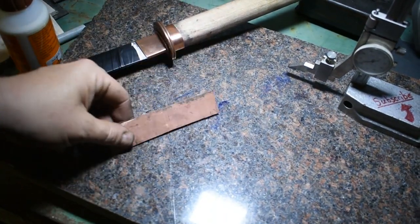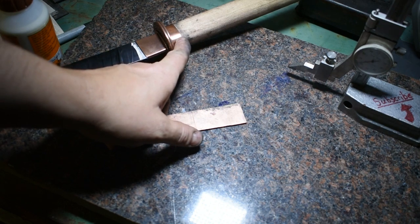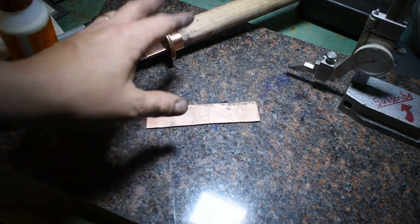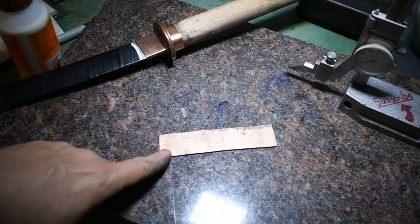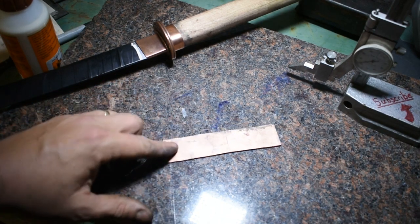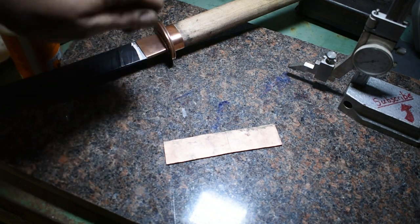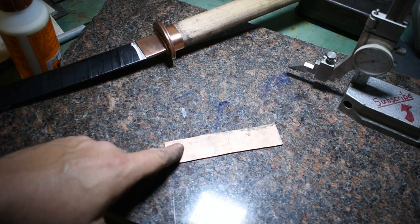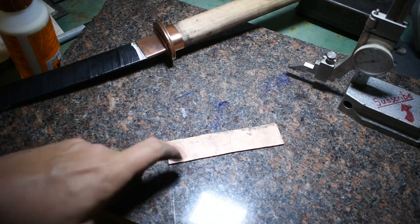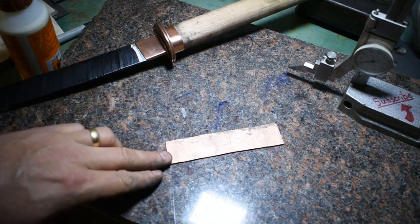All right, the way that I did it, for those of you that may be wondering, is I took some more pieces of the fittings I had, and I just ground the notch around, much like I did at the fuchi up here, and just rounded it around to fit the handle. And then I took a piece of this flat copper, made sure both surfaces were good and clean, laid the ring on there, fluxed it real well with flux paste, cut off little pieces of solder, dropped it inside of the ring, and then used a piece of the solder to solder where the ring went together. And then heated from the bottom, and of course all the solder melted, affixing the ring to the flat piece, and I soldered the gap. It's not perfect. I'm getting better. Whole point of this project is to learn as I go, but it'll work.